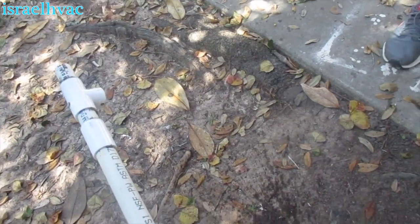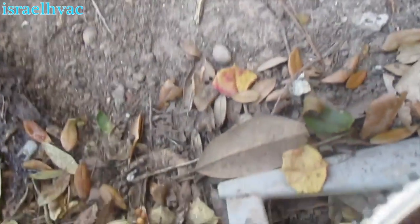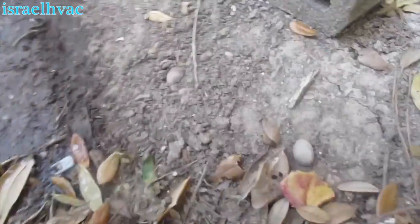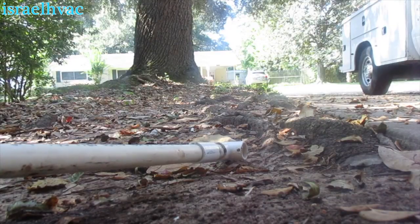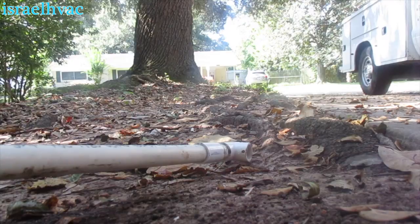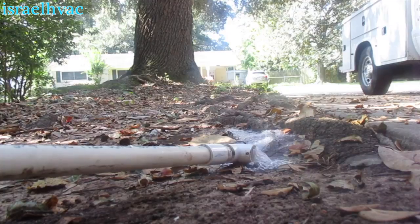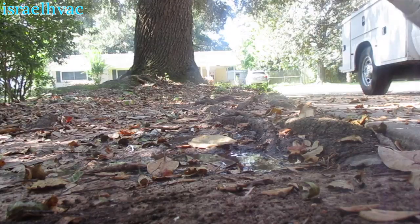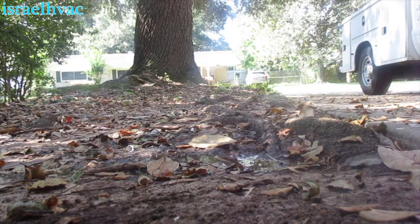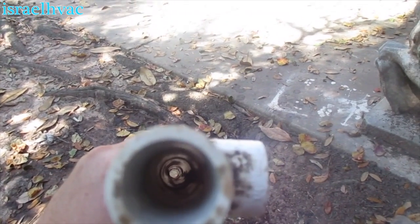I was able to get a section of the pipe out of the closet and I'm going to hook it up to this faucet here, because that's where it looks like it's clogged — see if we get some nastiness out the other end. It doesn't look too bad; it might be the other end that's clogged. Looking down the pipe, I can see all the way down — it's very clear. So this is not the issue right here.